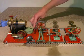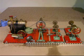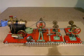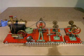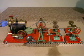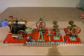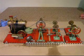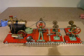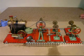You will also notice the earlier flat bases on these engines don't have retaining ears for the wick burners. Those particular features may have come in during the latter stages of flat base engines - maybe 1952 or 1953, difficult to put an exact date on it, certainly a little bit later. So it just means the lamp does move around a little bit, whereas the ears actually tend to keep it in position. But there are lots of little tell-tale features which give away the manufacturing date, or give the owner an idea of when the engine was actually made.